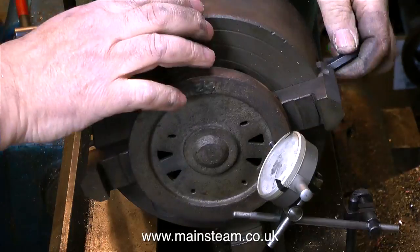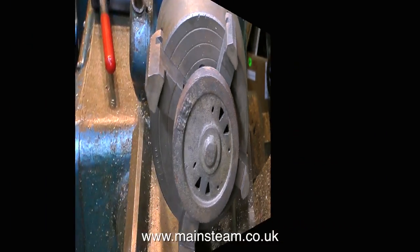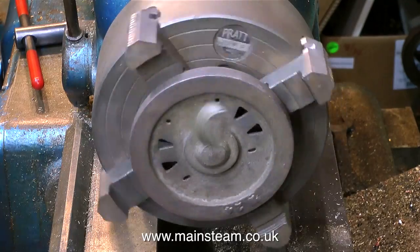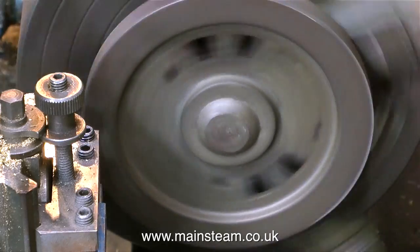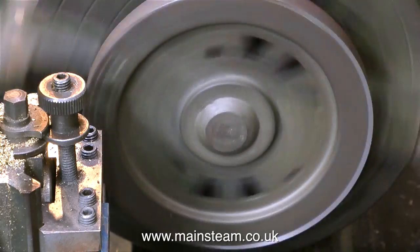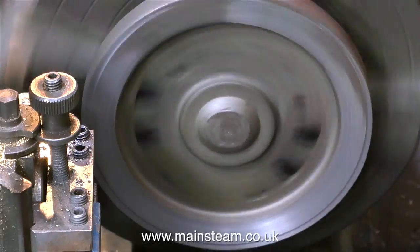I've made a few locomotives over the years and I've machined quite a few wheels and I generally do it this way. There are other ways of doing it — I'm not saying this is the correct way, this is just the way I do it. I mount the casting in the four-jaw chuck with the back side of the casting facing me, and with a little help from a dial test indicator — although it could just be a pointer — I'm attempting to make the casting run as true as possible in the chuck. The part I'm interested in is the inside edge of the outer part of the casting, and apart from making sure that runs true, I need it to run quite true front to back, otherwise I may take too much off one side.